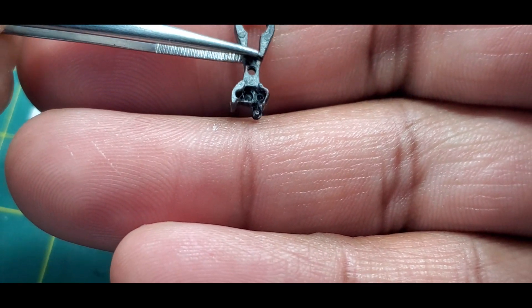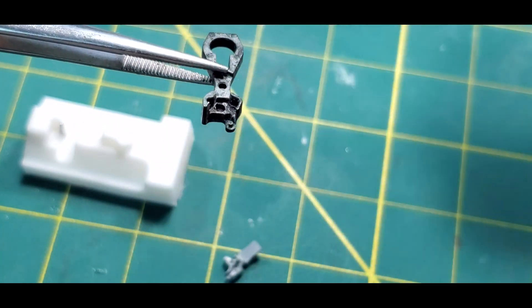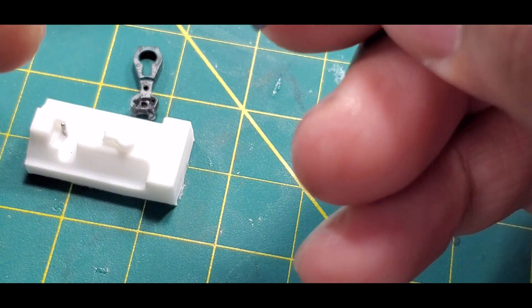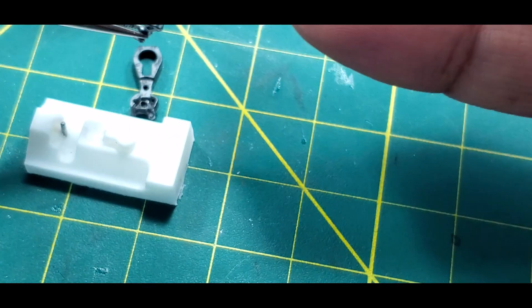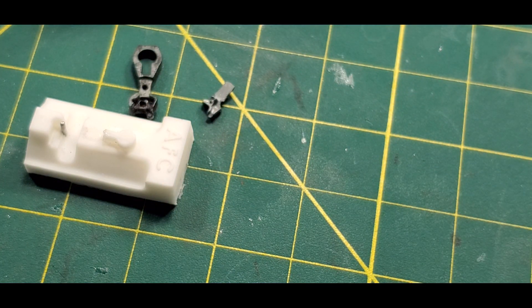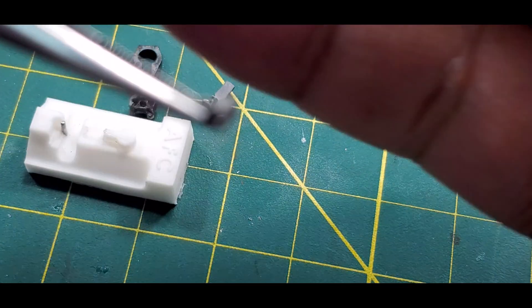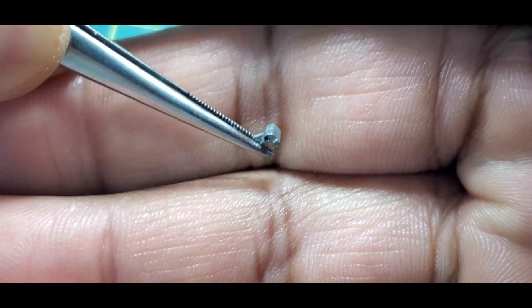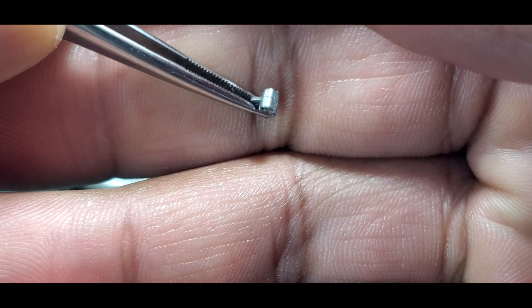Here we look inside the coupler. There's a little pin right there — the knuckle sits in that on the top piece, which also has that pin. You can see where it sits inside the knuckle, through these holes right here. That holds it together and allows it to pivot and swing. There's a ball inside there that locks it in place.